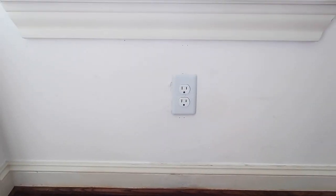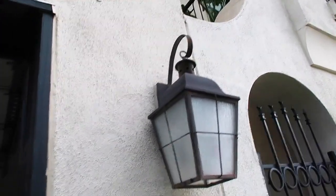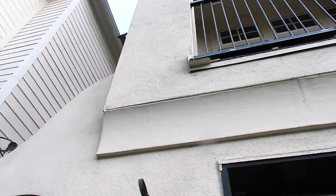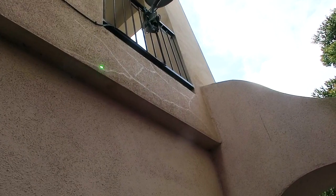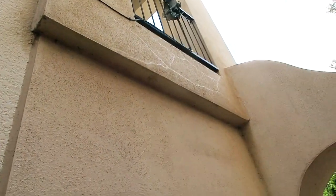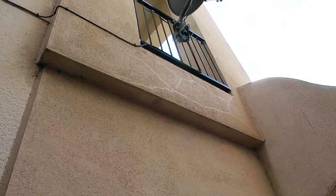We're also looking at the exterior stucco. Some problematic areas I see: splits between where the neighbors are joining, penetrations from drilling into the stucco, and faint water lines. I want to test this spot and retest where someone's tested in the past. I'll also test the center of the deck and right underneath the balcony. Our biggest worry is right over here — you can see a lot of spider cracking in this area and it's actually bulging out. When it bulges out like this, I'm pretty positive I'm going to get a positive moisture reading and a compromised substrate.